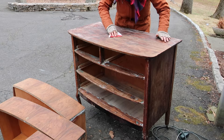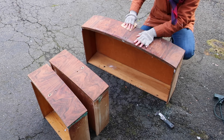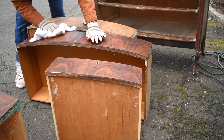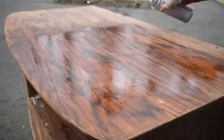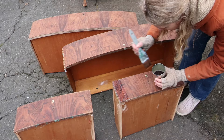Once all the paint had been scraped off, I wiped down any excess stripper so it didn't leave behind a film. With 120-grit sandpaper I carefully sanded with the grain to remove any remaining paint residue or imperfections in the wood — it's important to always work with the grain on raw wood. One of the Mohawk products I received was a spray cleaner to remove wax and grime. A couple of times during this process I sprayed the surface and wiped it down with a rag to remove dust, wax, and debris.